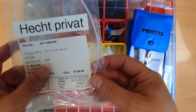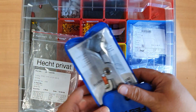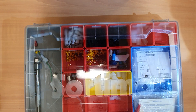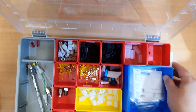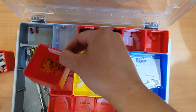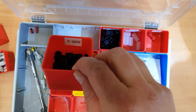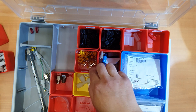For this you'll need a piece of tubing. I'm using 1/16th of an inch tubing; 1/8th of an inch is also commonly used for HPLC. You'll also need a tool for cutting the tubing, and from the IDEX catalog, the tubing fittings. These are located in one of our storage boxes labeled HPLC. The fittings for 1/16th of an inch are the P252 nuts and the corresponding ferrules, the P259X. For 1/8th of an inch you use the P332 nut and the P359 ferrules.